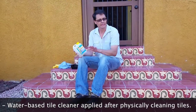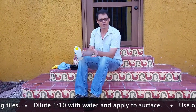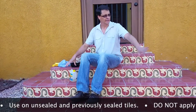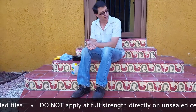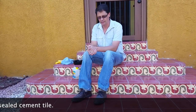The product we've been using — this was already cleaned with — is the Fila PS87. It's a water-based cleaner. You mix it in a bucket of water, five to one, and it makes a soapy solution. You just wash it all over the tile and clean everything off. We rinsed it with a hose. If you're inside, you wouldn't have that luxury — you'd have to wipe it down. Once everything's clean and washed, you want it to dry nice and dry, and then you can prepare the sealing process.